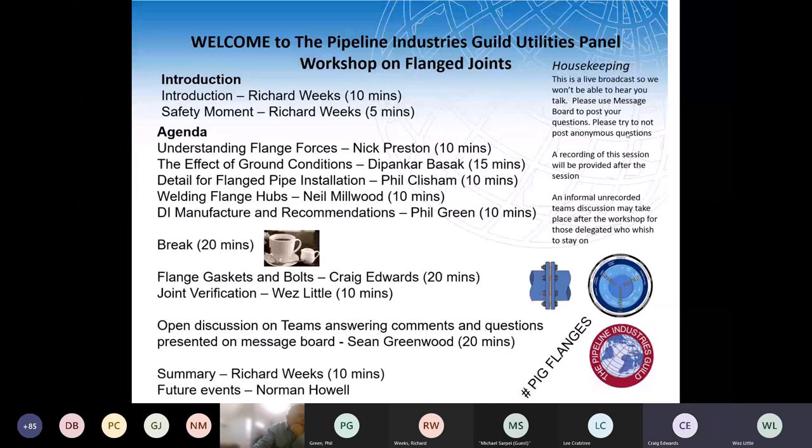No, as I say, stress relaxation within the flange, the bolt and the gasket are always something to be aware of. So again, even just running a little test yourself, follow Wes's installation methodology, it's best available techniques, and then check for stress relaxation. If you don't witness it in that specific type of assembly, using specific components, you're not going to see it in others. If you do witness it, take remedial action.